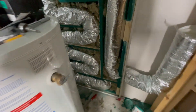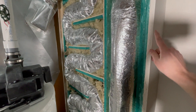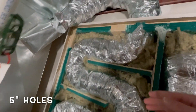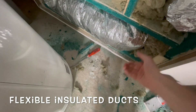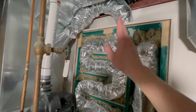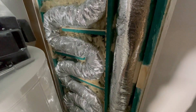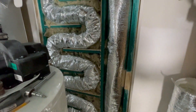I put on the same drywall as here — this is the 5/8ths Fire Code X heavy, dense drywall. I put it around either side and then drilled a hole coming through and one up there. Then I put in the ducts. I put in the bottom duct first and put it through the hole, added the plastic porthole to the other side, and then weaved this through and stuck it through. Then I did the same for the top — pushed it through the hole all the way through the wall to the other side and had it come down and stick out here.